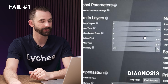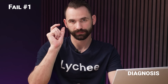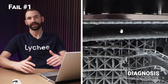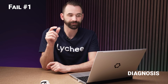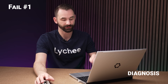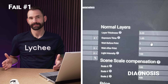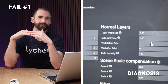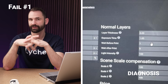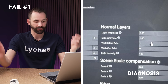It's going to cure that really thick layer for 31 seconds, and there are five of those. You're probably going to get five layers that are really, really thick — double or more than they're supposed to be. Then it will go through the eight transition layers, and those will also have a lot of cure time, giving us really thick layers. That's why we get that thick raft — you're curing a much thicker layer than you're supposed to. Once we start transition layers and normal layers, we're only curing for 1.85 seconds, which isn't enough to cure that thickness of resin — instead of 0.03 it's probably 0.06 minimum — so you start getting weak bonding, and it separates and peels apart.